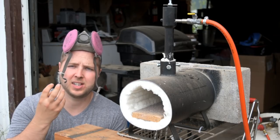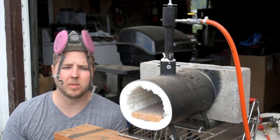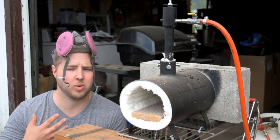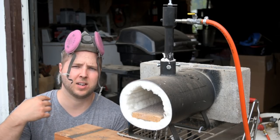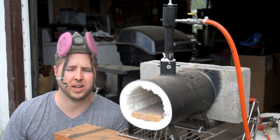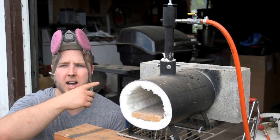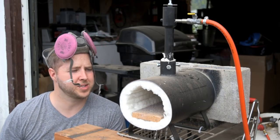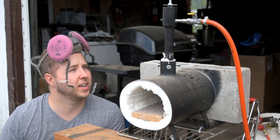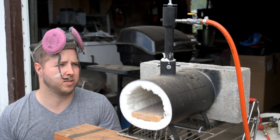This is my little forge — I believe a 10-inch by 6-inch capacity. It's a beautiful little system I bought from Devil Forge, great price, runs fantastically. However, the inside is lined with what's called kaowool, which is a ceramic wool liner. As it gets beaten with the compressed air it breaks down, releasing fibrous material that becomes airborne — really not good for you, somewhat similar to asbestos. Use it in a well-ventilated area and always wear a respirator. You can also buy a rigidizer or furnace cement to coat the interior — I just haven't gotten around to that yet.